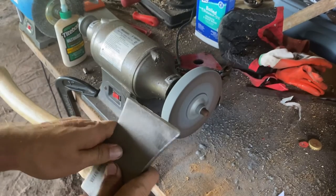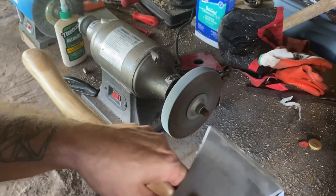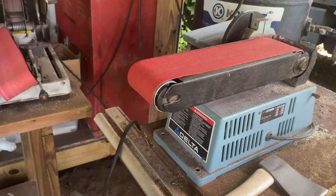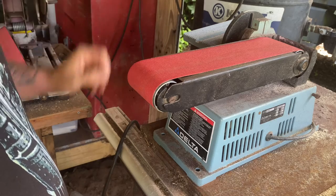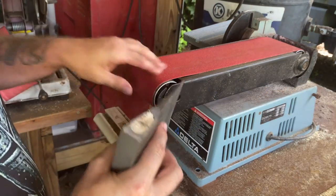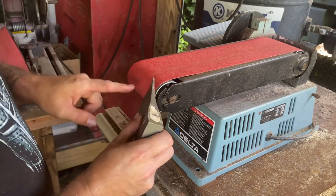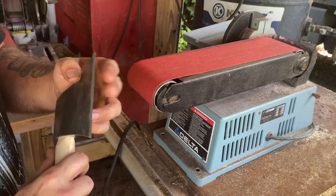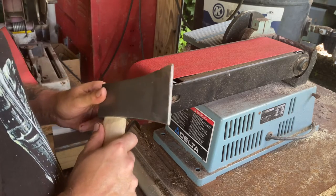Don't hover in one spot too long — if this heats up you've ruined the temper of the steel, so make sure you keep it moving. Now take it to the belt grinder to clean it up a little. Unfortunately I don't have a proper knifemaker's belt grinder yet — I'm working on that. This is a belt sander. I'm going to do it on the round part here just because this is really long and broad and I don't feel like having it rip out of my hands. Just make sure I keep it moving so that it doesn't grind a dip into it.